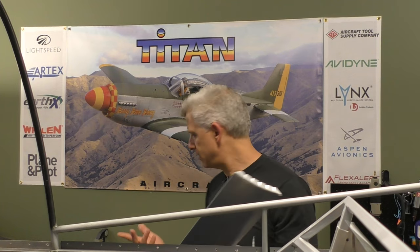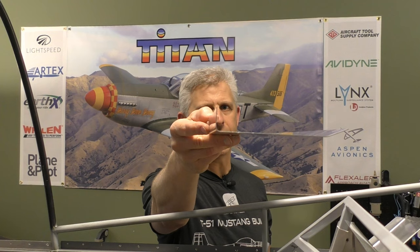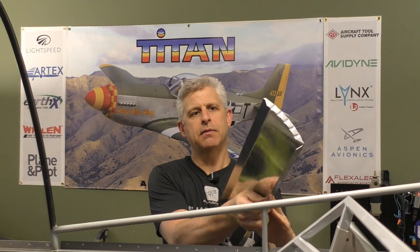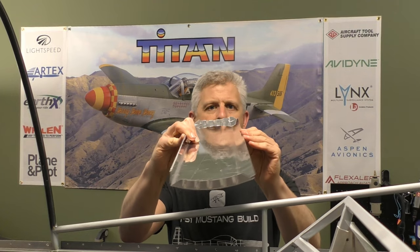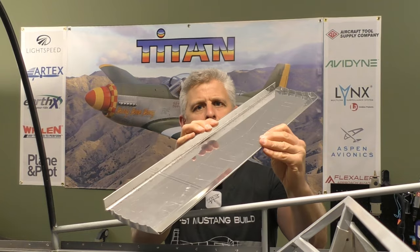So an idea that I had to do this is to take a sheet of metal, which I've already gone and cut here, and this is 032 aluminum, and I'm going to put a 90 degree angle on one end and a little bit like a 10 degree angle on the other end. Now you see you have this nice curve on this sheet. By doubling this up in the middle, just sandwiching this piece right in here, what you get is essentially a box structure. So you come down and you go straight across here, as you can see it.